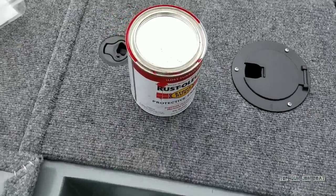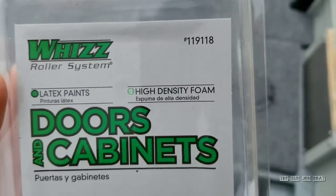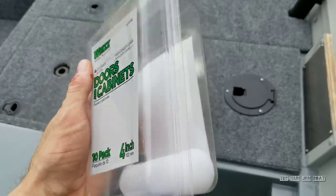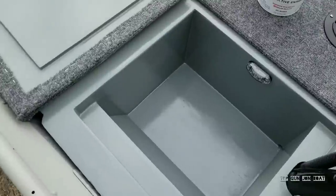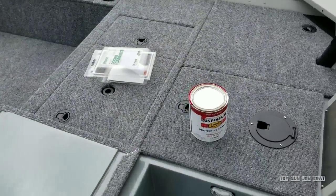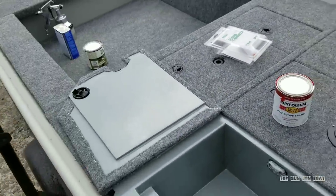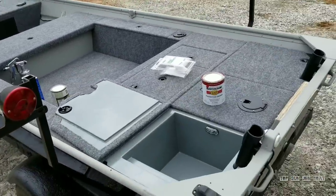The only thing I do a little different is I coat all of my wood and hatches in fiberglass resin to water seal them even more so than just applying the exterior oil-based enamel. What I do with this is I like to use a high density foam roller — these are four-inch doors and cabinets rollers. I love using these: they hold the paint, they roll the paint, the paint levels out nicely. It's just a foam roller — that's how I paint my hatches. They're compact enough in the four-inch size that you can get into tight spaces. With a little cheap brush you can hit your corners, and all your flat stuff you can hit with what I like to call a zippy roller — that four-inch high density foam roller. So everything — wood, framing, hatches — coated in oil-based enamel, and the actual aluminum boat coated in that Seahawk AlumiHawk. And I think it's time we go ahead and paint a hatch and do a step-by-step.